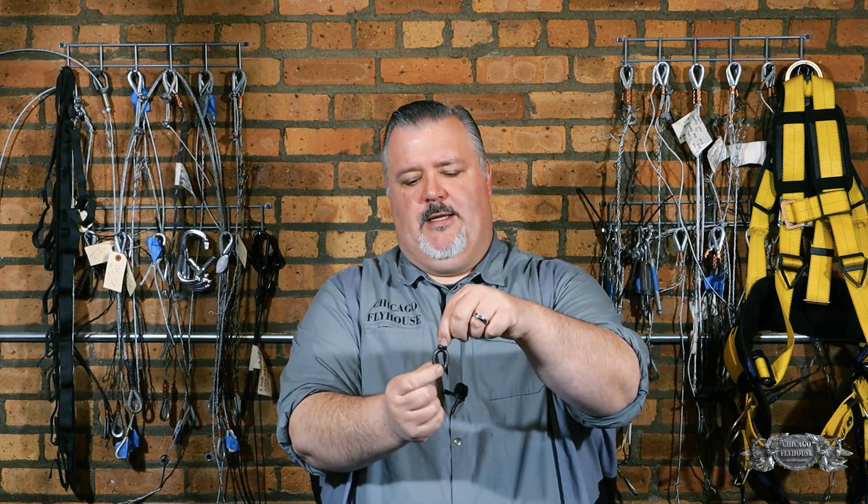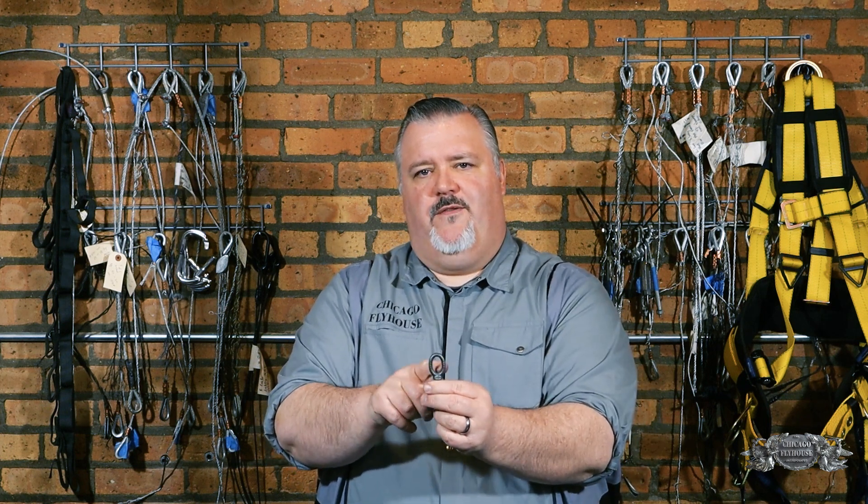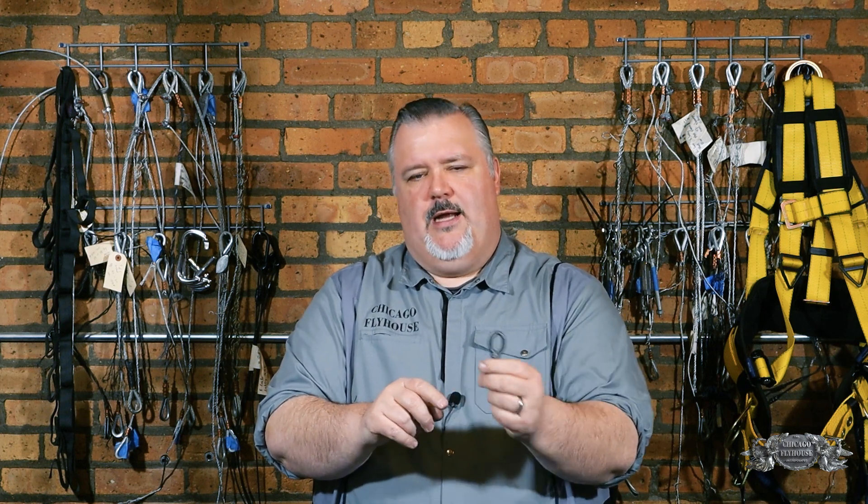The other thing to consider: look at this one that we pulled — this is the strong one that we pulled like this. We took it to the limit of our testing equipment, which was 3,000 pounds in this case. We pulled on it with 3,000 pounds, which is six times what its working load was — that's a pretty good design factor. But we can see it's definitely deformed. So the other takeaway is that not only do we use hardware that's going to have the strength and properties we need, but we also have to be inspecting it. We have to look at it before we install it and look at it when it's installed to see if it's giving us any signs that it might be getting close to failure. This was obviously close to failure when we topped out our scales.